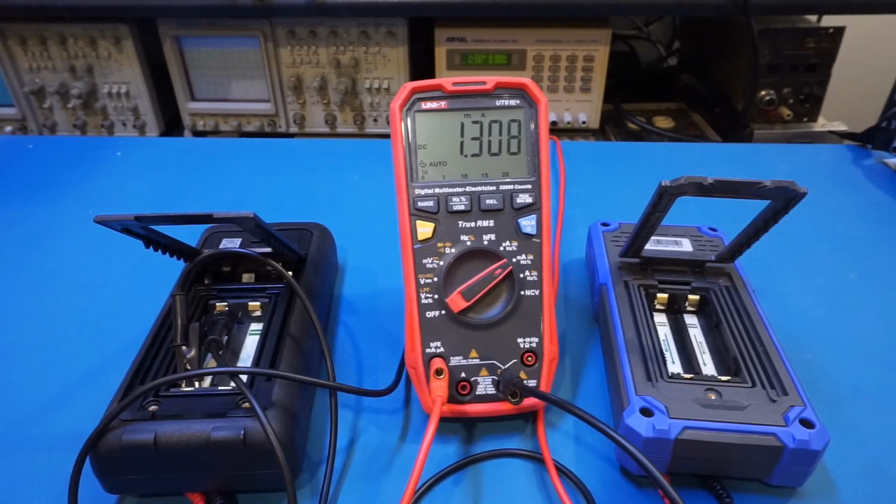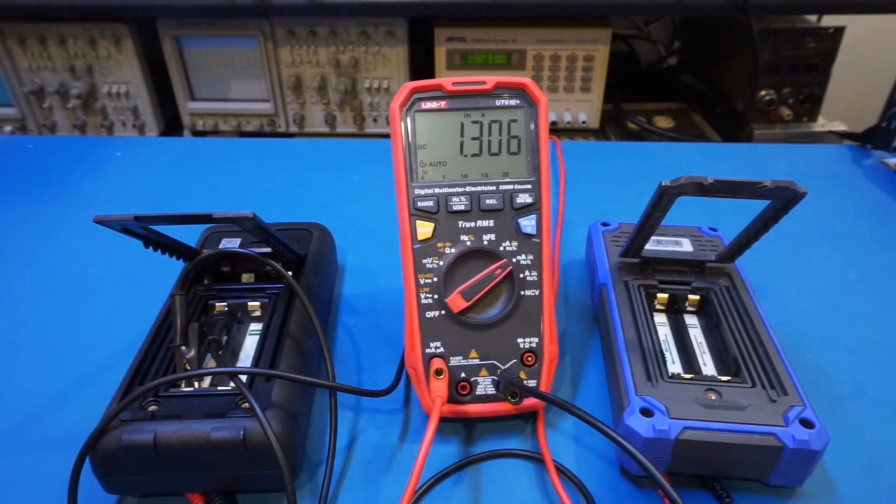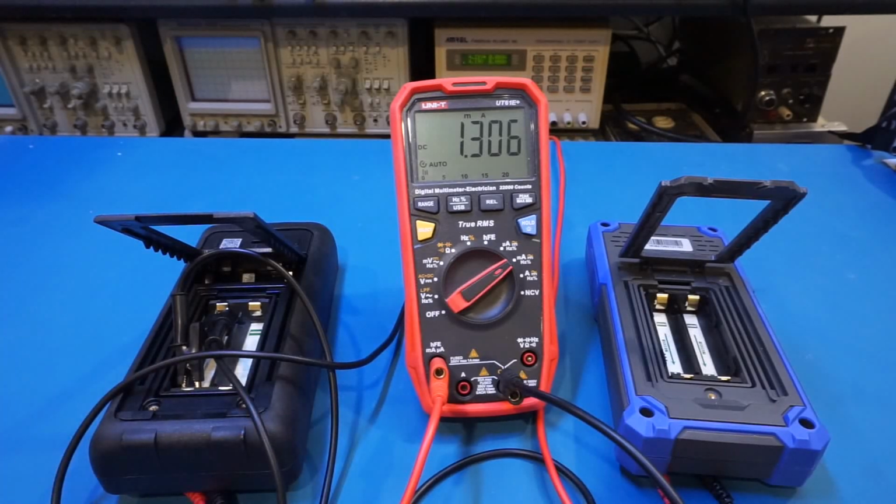For the Hantek 2D72, you have two of these 2.6 amp-hour batteries. Doing some back-of-the-envelope calculation, you will see that it takes roughly 4,000 hours to fully discharge a fully charged battery. That translates into 166 days, which is not that great. It's just shy of half a year. So just something to keep in mind: if you do intend to store this scope for a long period of time before using, you might want to double check the battery situation before using it.